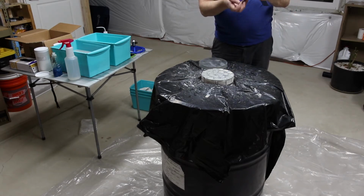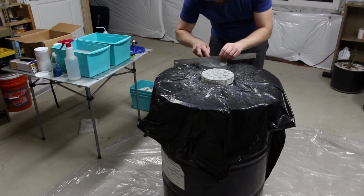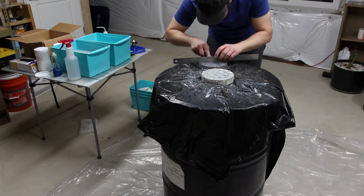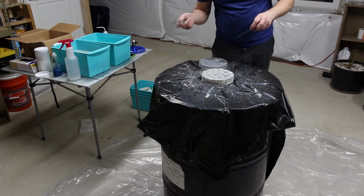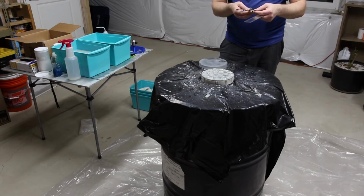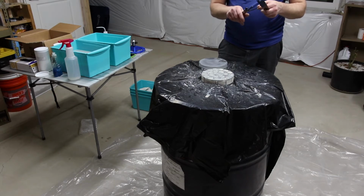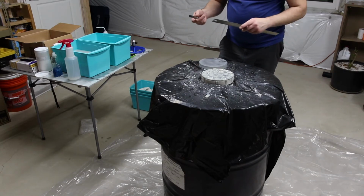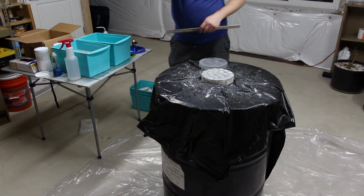35. So the thickest that I have here is 35 for a single feeler gauge. Yeah, so it doesn't quite fit under there. So that tells me it's probably about 34. So we managed to get 32 and not quite 35, so probably 34. Every time I go around and do another wet, I'm looking at about another 2 thousandths of an inch.